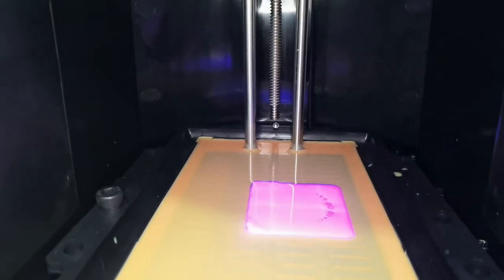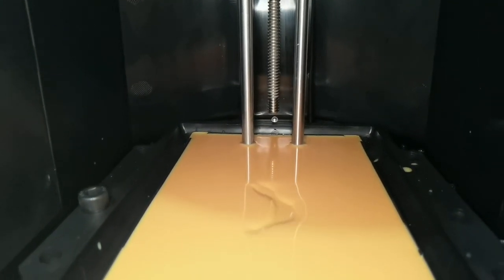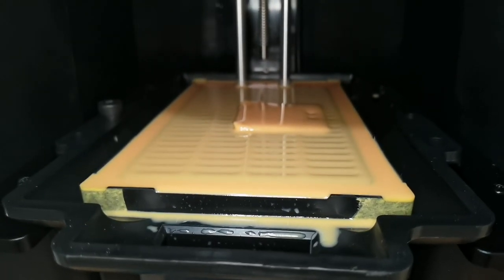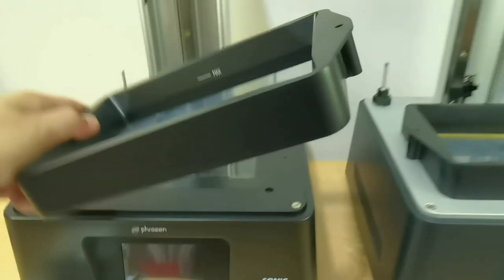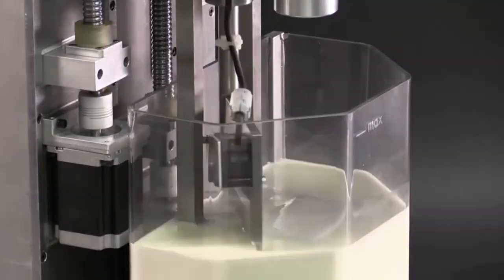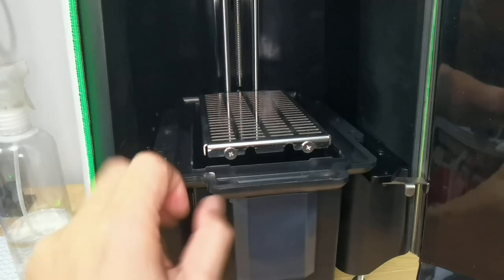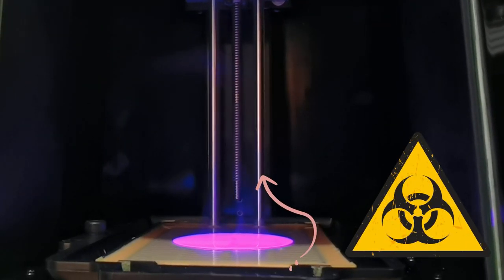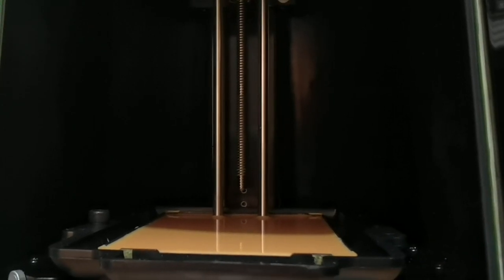For troubleshooting, if you're having a hard time with this printer: don't print flat or use flat orientation due to surface tension, and minimize your support bottom contact with the plate. On a bottom-up printer, the FEP and screen help keep things flat. On most top-down printers they have a wiper to help level the surface and minimize blooming. On this printer, there is no wiper. The full layer projection creates heat, and the shrinkage combined with surface tension causes the exposed layer to shrivel or curl up, causing print failure.